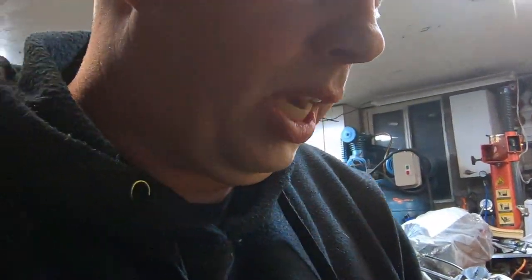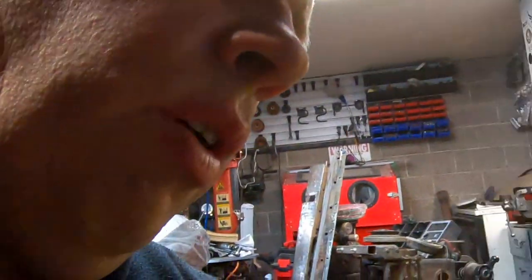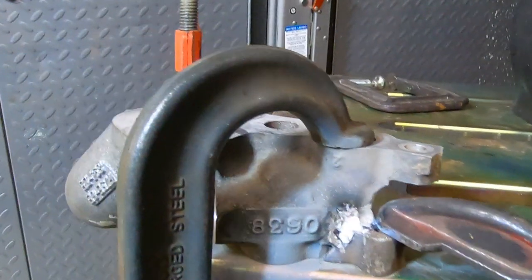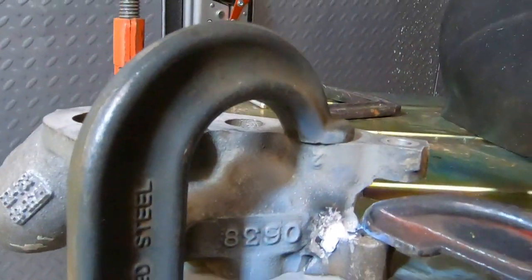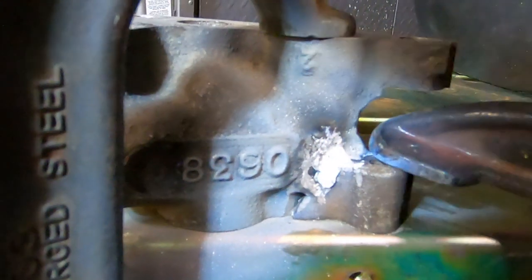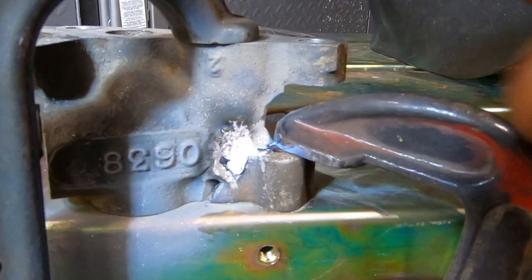It's not an inverter welder. It's pure transformer. There's no electronics in it other than capacitors, things like that. So it'll outlast me, and it's more than capable of doing this job. So I've got the continuous cleaning on here to be scouring the surface, and I bumped up my start amperage just a little bit so that we hit this a little bit hotter right off the back. So I'm having to really ramp it in.